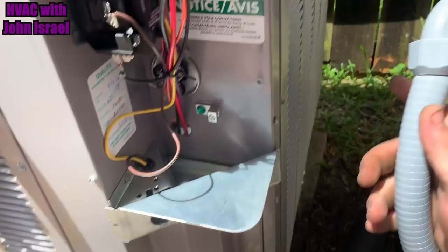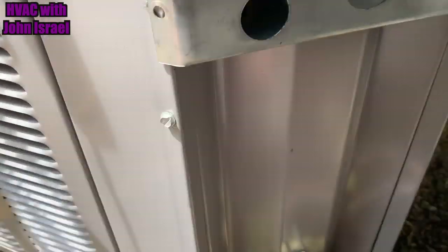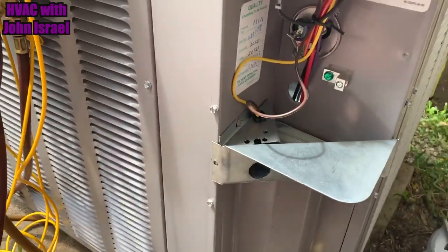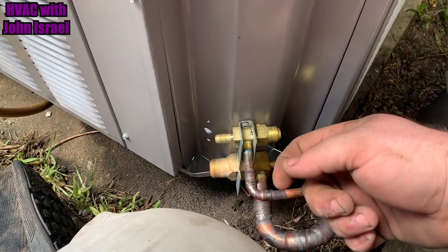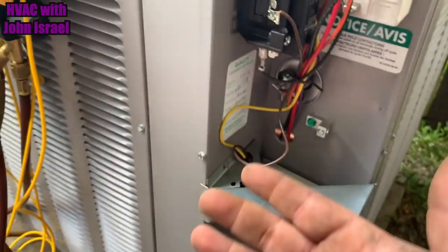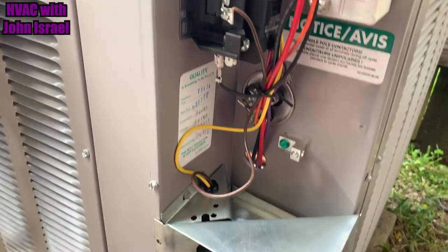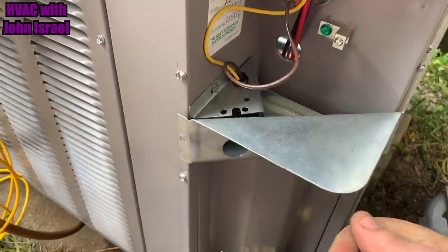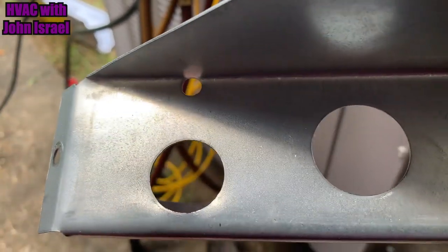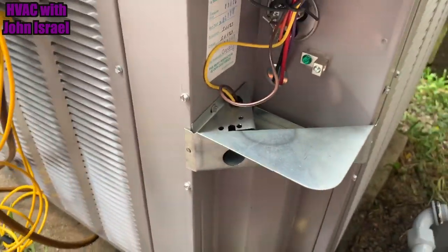I'm getting ready to hook up my new whip on this Weather King cube. I've seen a lot of guys complain about doing electrical — you've got to get under here and stick your fingers back here. It is a bad design, I totally agree. Another bad design is these valves — they should bring them out further because it's hard to get your service tool in here. But you have to adapt and overcome. This is a good unit, other than a couple of the designs, and it's priced cheap for jobs like this. But if you simply remove this screw and this screw — a lot of you may know this already, I'm just helping the guys that don't — you take this out, hook your whip up, hook that BX up for the low voltage wire, and you have full access to tighten up the lock nut. Then just slide it back in place and put the screws in. Nothing to it.